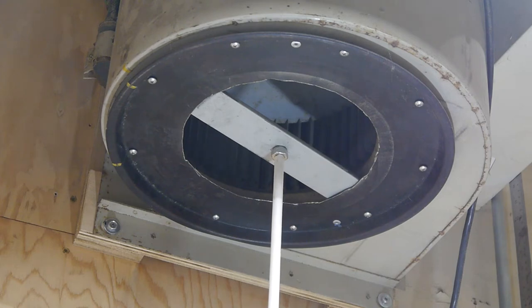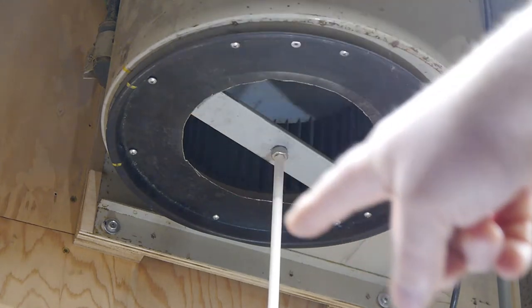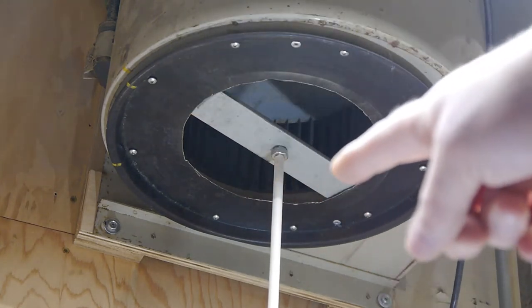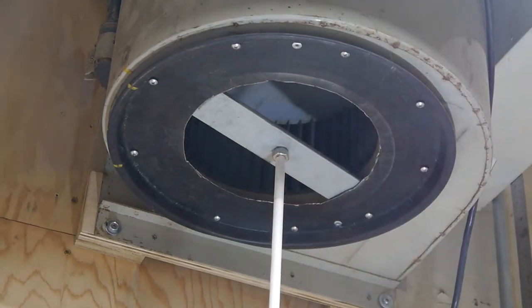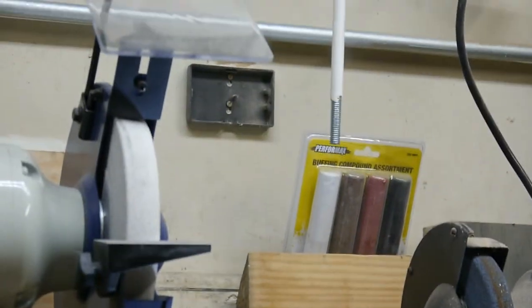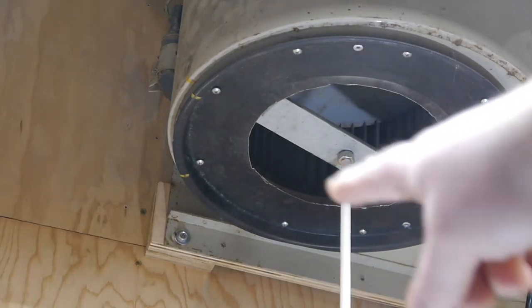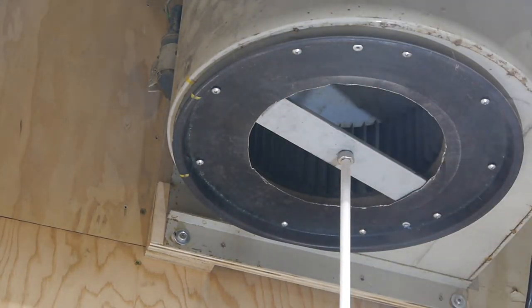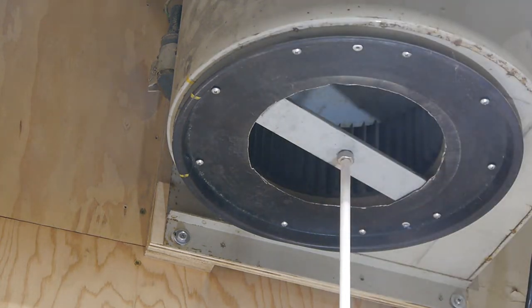Anyway, so I kept it, cut a hole in the center. There's a piece of 2-inch by 1/4-inch steel with a 3/8-16 hole in it for the 3/8-16 all thread that goes down all the way to there, like so. And then just sheet metal screws screwed in. Well, you can see I just kind of did it ad hoc. A couple rivets to hold it initially, and then a bunch of sheet screws to hold it up there. And that's straight to the outside.